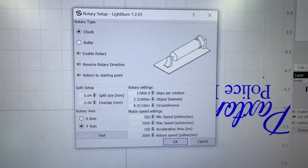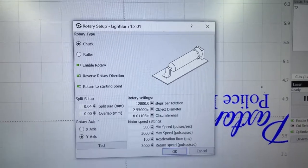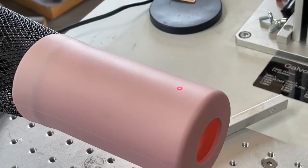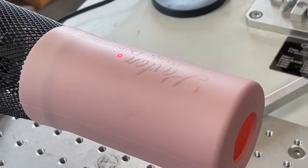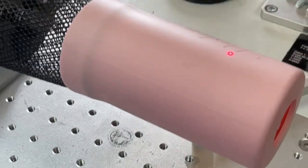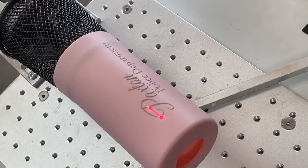We're going to come over here and frame it — I'm happy with it. I do recommend defocusing it for this purpose. Here are my rotary settings in case anybody is interested, and then I'm going to start the job. By default I use two passes, however sometimes you might find it is a little bit too light depending on the color you have, so don't be afraid to go over it a time or two to get it a little bit darker to your liking.